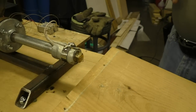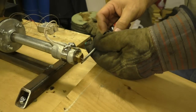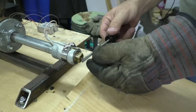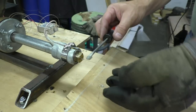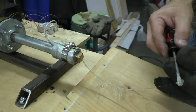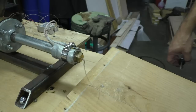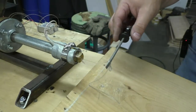I've got this up to temperature; the nozzle is sitting there oozing plastic, so I know it's ready to go. I'm going to chop that off and hook up the motor. There we go — it tends to want to stick, which is why I'm wearing gloves. Once you get it started it's not so bad, but sometimes it wants to stick to that nozzle. That crunching noise is just the bit shearing off those pellets before they go in the pipe.